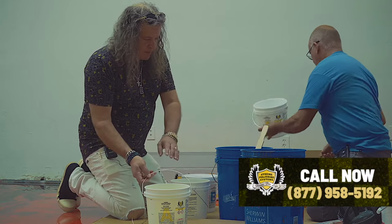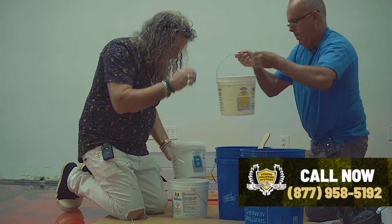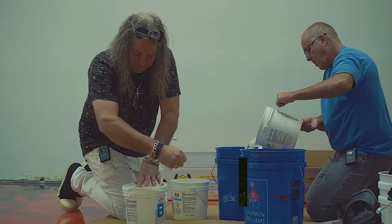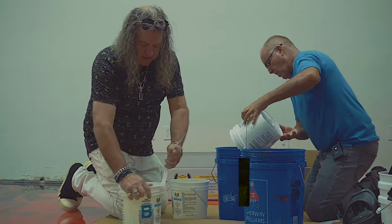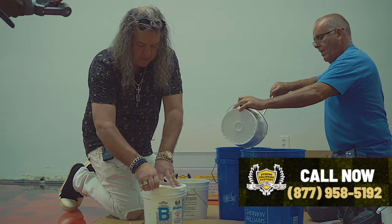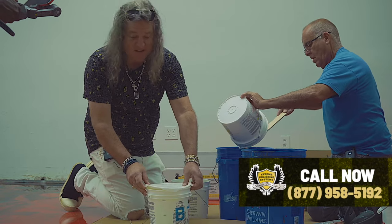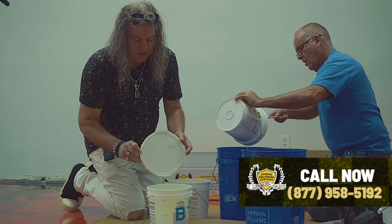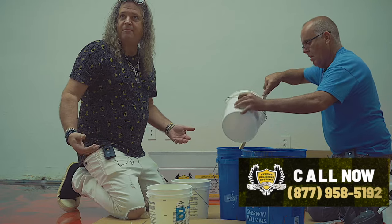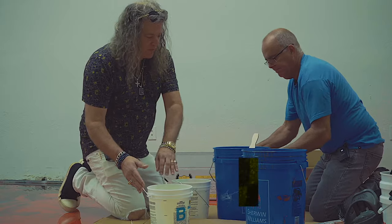We're going to take our B and add the A's. You want to make sure you get the B's in with the A's, because otherwise it won't harden. We've had people apply epoxy before and say the floor never hardened. They went back to see what the problem was and the mixer had all the B's set to the side in a closet — they just poured the A's onto the floor thinking it was going to cure, and of course it didn't.